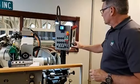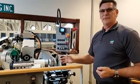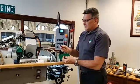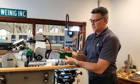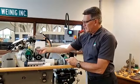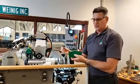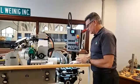Okay, so what does a grinder do? A grinder is very similar to a very large key machine. We have what's called a tracing pin or a stylus, some folks call it. But that stylus is going to follow along in the profile itself. Okay, so in order to create a one-to-one as to what this template is, our stylus or tracing pin has to be the exact same width and shape as what our wheel is. If either one of the two of those are off, we will never produce the same profile. So it's very important that we have the right stuff in the right places.